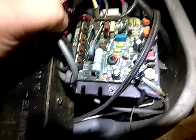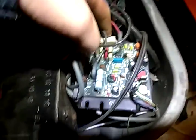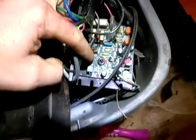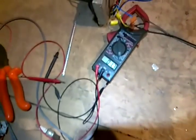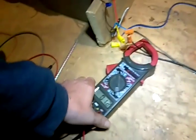This thing cooks through a bunch of wattage when all this is hooked up — it's got this huge resistor on there fighting the current. You've got to have some loss there. It looks like a good circuit, it's very tunable, but it's not practical — that's the problem. We're at 1.2 to 1.3 amps — and that's our alternating current consumption. That's the equivalent of the cheapest power inverter you can buy, basically. 100 watts.